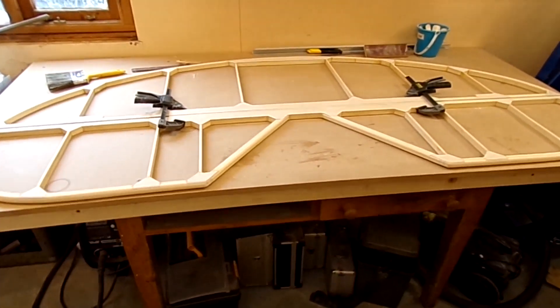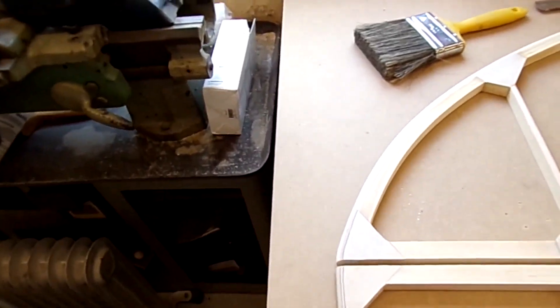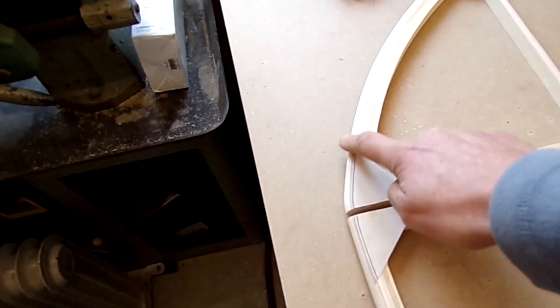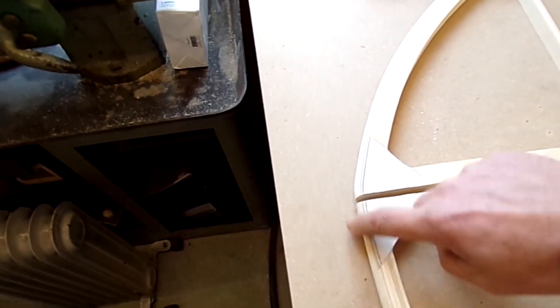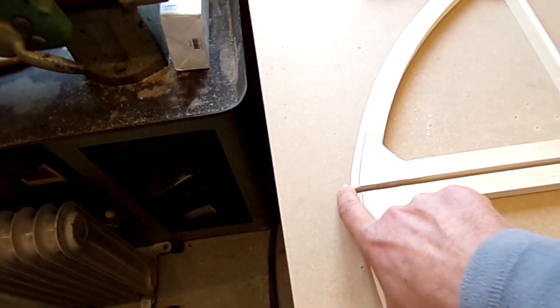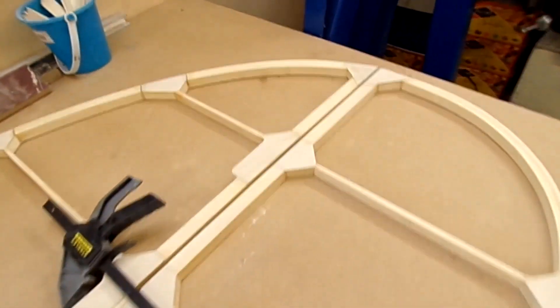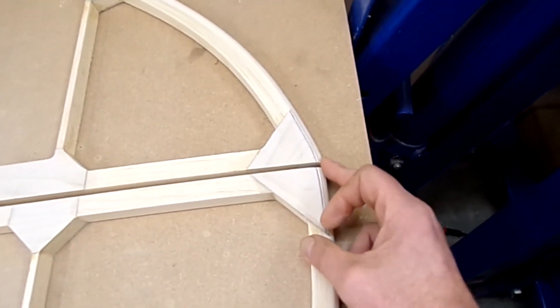Just let me show you — the tip of the horizontal stabilizer is matched with the elevator. About a sixteenth to an eighth of an inch had to come off at both ends — just slightly less than the thickness of a lamination. At the moment I've got this strip of wood here representing the hinge thickness just to help me align that.